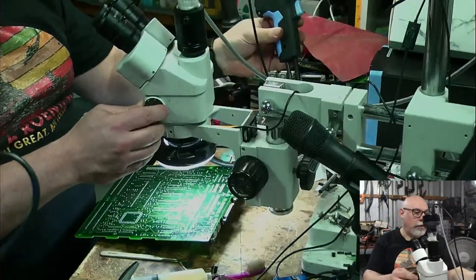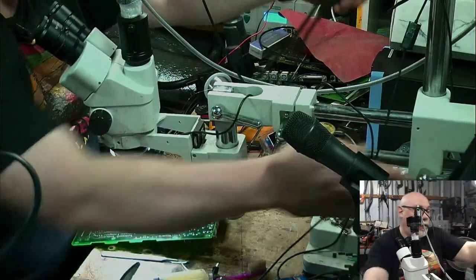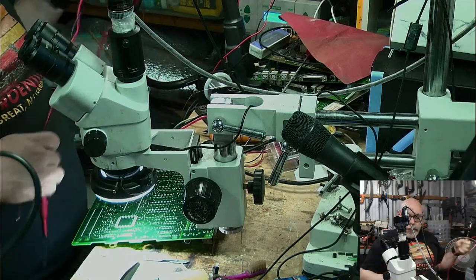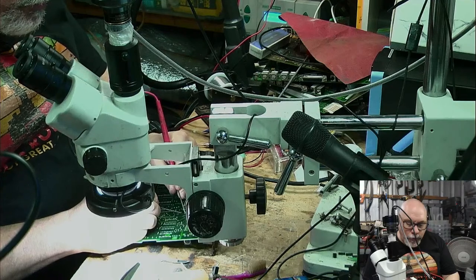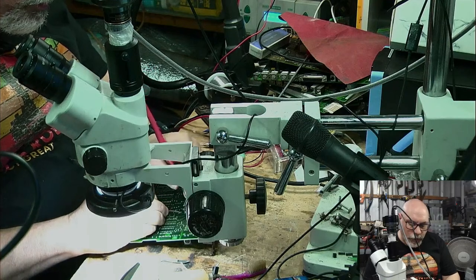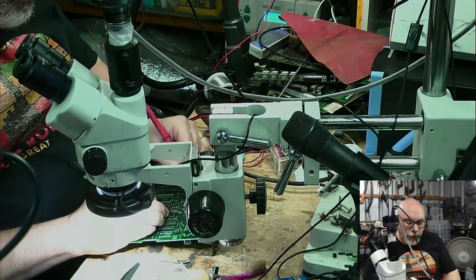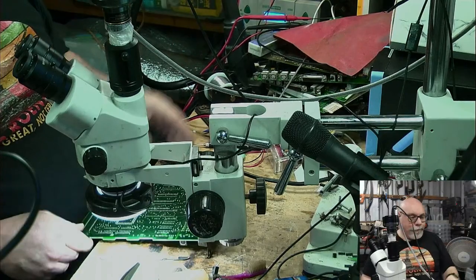Try buzzing to the battery connector. Now that I've actually seen there's plastic on the other side of it, I don't think it is, but yes, I could do that. Let's go beepity beep beep on the multimeter. Nope. Okay. Nope. I'm just checking the power rails here. Nope. It's a nothing. Looks like it doesn't go anywhere.